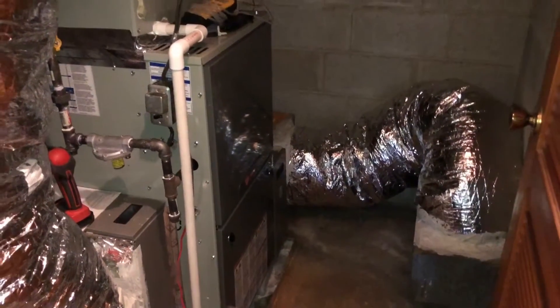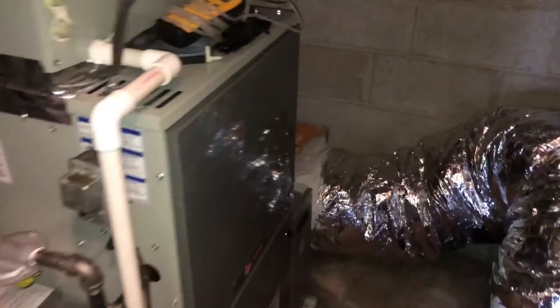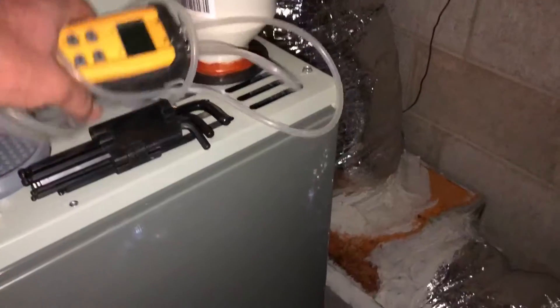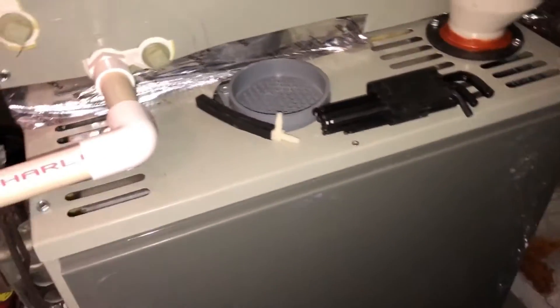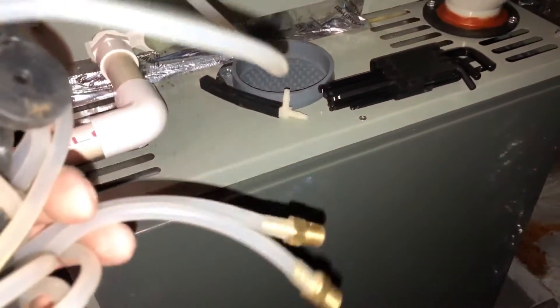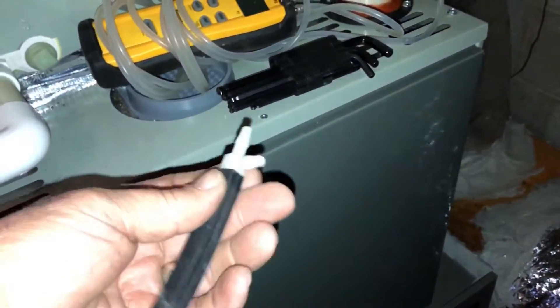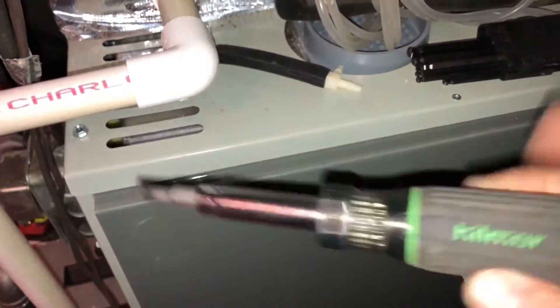The install is done and we fired it off. What I'm going to do now is go through the setup procedure for the gas valve train. High-end furnaces do not come perfectly tuned, so we're going to need our dual port manometer, a T, our Allen wrenches, and a screwdriver or the trusty six-in-one.